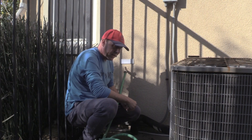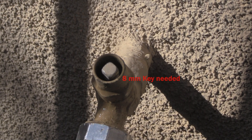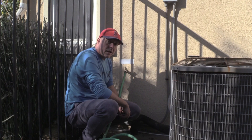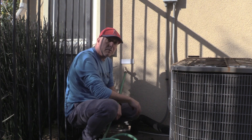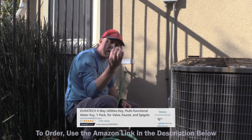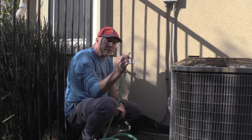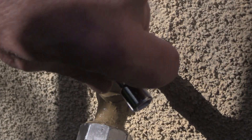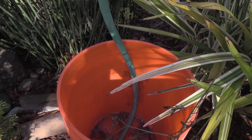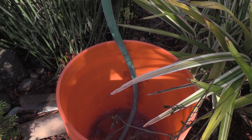Our hose is attached. Now we need our key — this is the keyless hose bib. They do that so you don't inadvertently turn on the water; if you had a standard spigot here, somebody could turn that on and set your fire alarm off. I got this key on Amazon for less than ten dollars — about eight dollars. There are a couple of different sizes. Drop it in, twist to start the flow of water, and let it run for a little while. I'm running it into a bucket so we can see how dirty the water is, and you can see why it's important to do this fairly regularly.